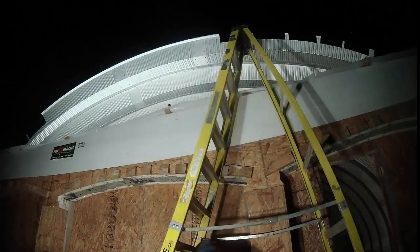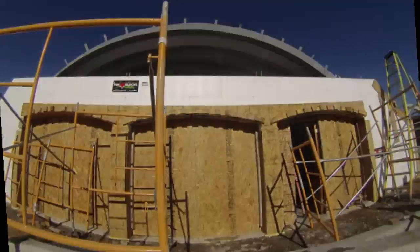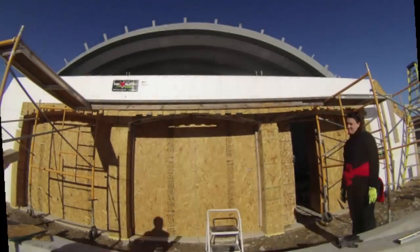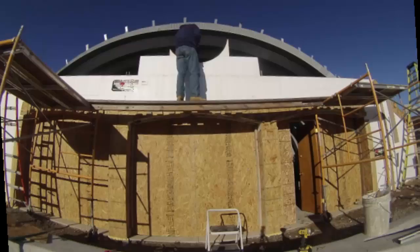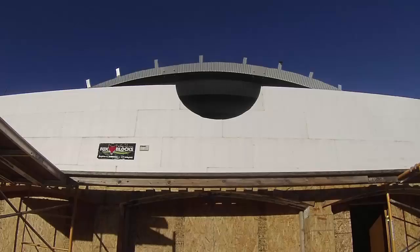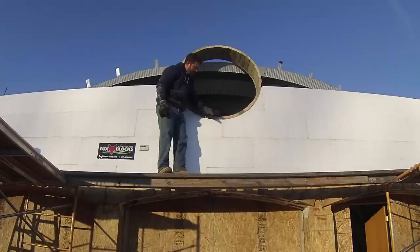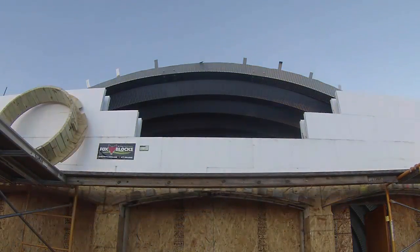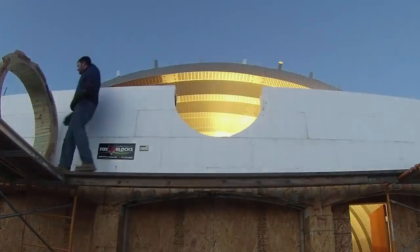Then I finished trimming the Quonset hut. Back out again with Sherry and we set up the scaffold for the south wall. We added some 2x4s to stiffen the 2x12 bridge span. Then we drilled additional holes for rebar, vacuumed up the dust, and started stacking. We got the window buck up and in place, but it was clearly too high — oops. We decided to take it down 12 inches, but I used the template for the inside hole, not the outside hole, so we had to pop it out again and trim off another inch and a half. It fit.